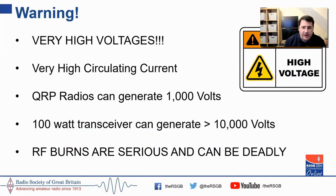It would be remiss of me not to put in a warning: RF burns are serious. They can be deadly. It's the volts that jolts, but it's the mills that kills. Be careful. Be vigilant. Safe operating procedure: do not touch the loop when you are tuning it, especially if you're operating at 10, 20, 100, 400 watts — or for those of you in America, kilowatt-plus.